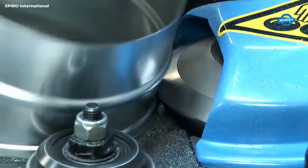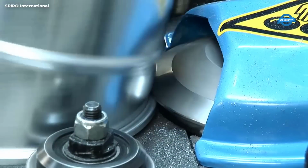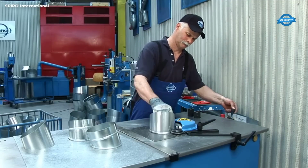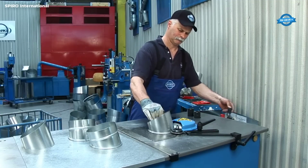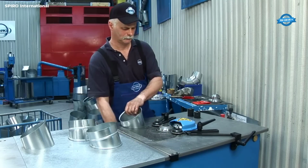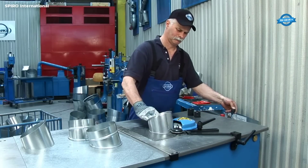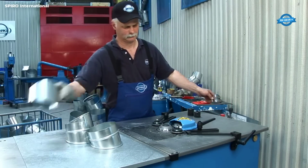The Gorelacker Combi T is a high-production machine designed for manufacturing standing lock seam elbows and reducers. It features two separate workstations, a flanging station and a seam closing station, enabling continuous operation without the need for equipment changeovers, which greatly enhances its flexibility.